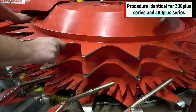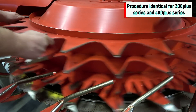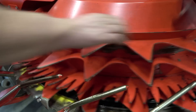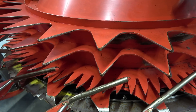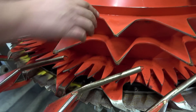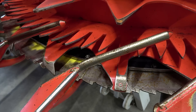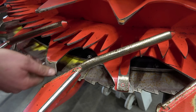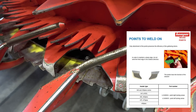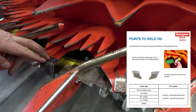While the drum is still loose, you should check all the teeth for wear and deformation. Bent teeth have to be straightened, otherwise the drums and the cleaners might be seriously damaged. If the header has been in the field for several years or worked a lot, the teeth on the bottom row might be worn. This may cause the drums not to be able to guide the plants properly. If this is the case, there are points available that have the shape of the teeth when they were new, and those points can be welded on the worn teeth.